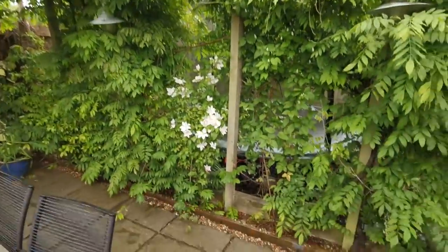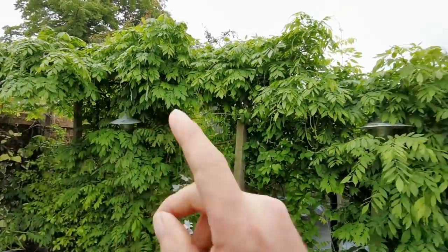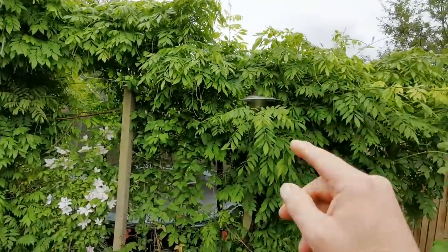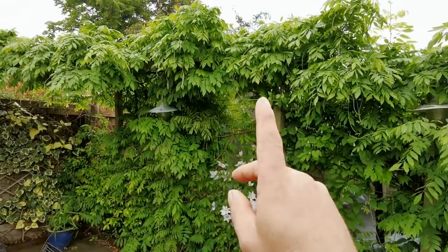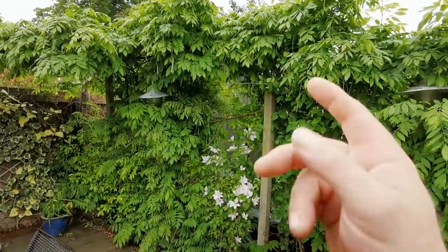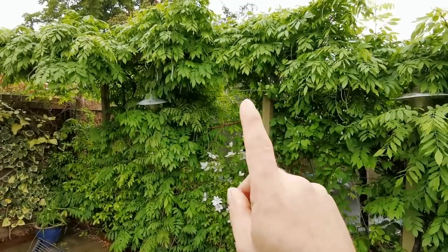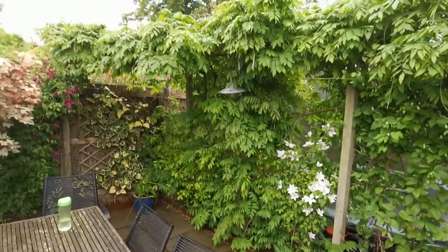Right, phone rang. But what I was saying is, at this point here, I've got that timber coming across there, one coming across the top, the big back rail that's going to be taking the posts that stay in. So I can't just have one post there, it's just too many joints, there won't be a lot of the top of the post left because I like to notch it. So I've got to put two posts in here somehow. I can't put one in here because it'll be in the middle of the deck, the flags, the patio.